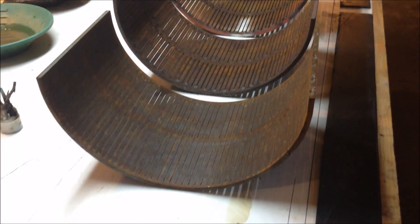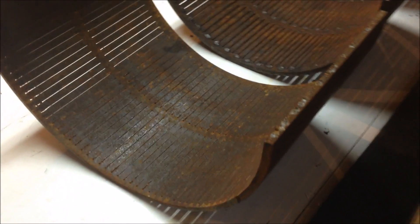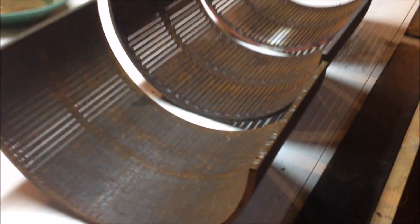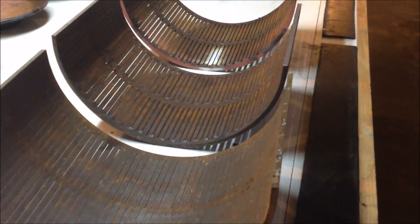Here are the screens we use in our hammer mill. The one we had installed for this test was this screen right here — it's a half millimeter laser cut slot in three-eighths AR 400 steel. We got about 50 pounds an hour plus or minus through with that screen size, so we're still in the experimental R&D phase. We have some different size screens — this one's about a millimeter, and this is a larger one at about two millimeters. We're going to play around with trying to get the throughput up. Maybe you don't need to grind it as fine, or maybe there's a two-step grinding process: grind it all to two millimeters through the first hammer mill and then through a half millimeter.